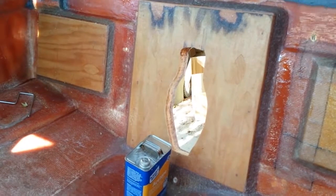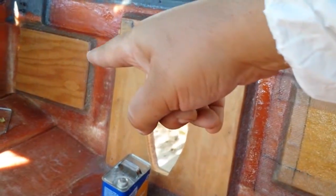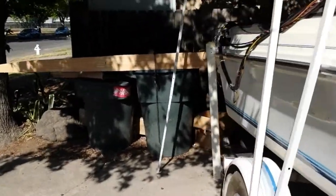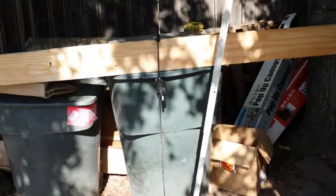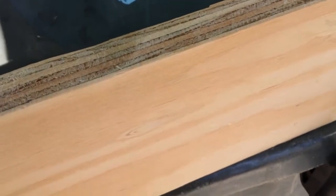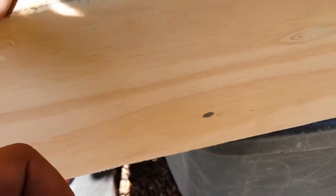But for now, I'm gonna use TP's method to tab in that side piece. Oh, here we go. One more thing, I set a stringer out so that in the event I have leftover resin when I'm setting up that side piece, I can use the leftover resin to waterproof just the sides of the stringer. I'm not gonna waterproof the end grain because I haven't cut it to the contour of the hole and really got a good fit on it. So that's what I'll be doing with my stringer if there's any leftover resin.